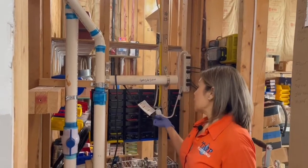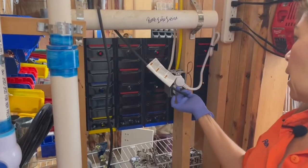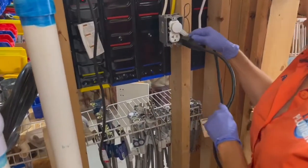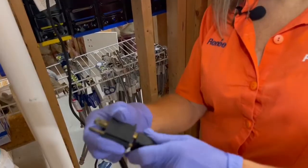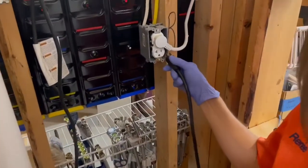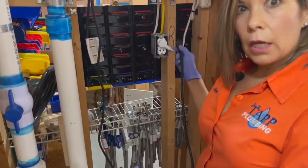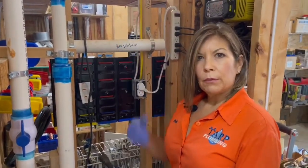Some pumps have just a single plug, which has the float and the pump all wired into one plug-in — that's what this one has. But some pumps have what I call a piggyback plug, where the plug that goes into the receptacle is actually your float plug. You can separate them and plug the back plug directly into the receptacle to determine whether the float is bad, or plug the pump in directly to pump the water out without activating the float.